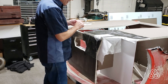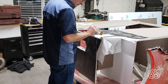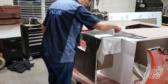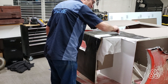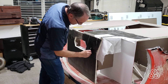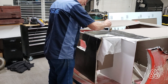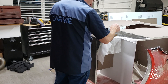Now pushing the fiberglass down into the pockets of these subframe mounts, clipping the corners and then wrapping the cloth around. Not shown in the video, but I did add a couple of layers into the bottom of that against the craft paper to stiffen it up. Same thing — get enough resin, squeegee it out to fill all the voids and remove any excess resin. After we get 40 layers or so built up on some of these areas, you're going to want to make sure you have as much resin removed as you can, because that's going to add a lot of weight with that many layers if you have excess resin.